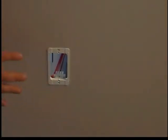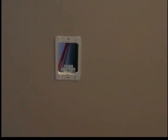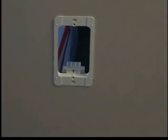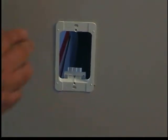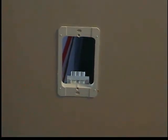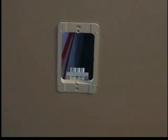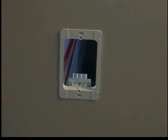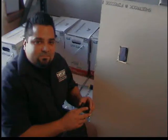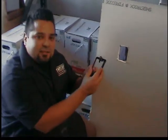On the front, the only complaint I've heard about this ring — and it varies from contractor to contractor — is the plastic. Once you put your face plate on, the face plate will sit out a little bit more than the other two style mud rings. Also, the screw holes have a kind of hard plastic, so if you're using a screwdriver manually and not a drill, it will take a little bit of effort to screw it in.